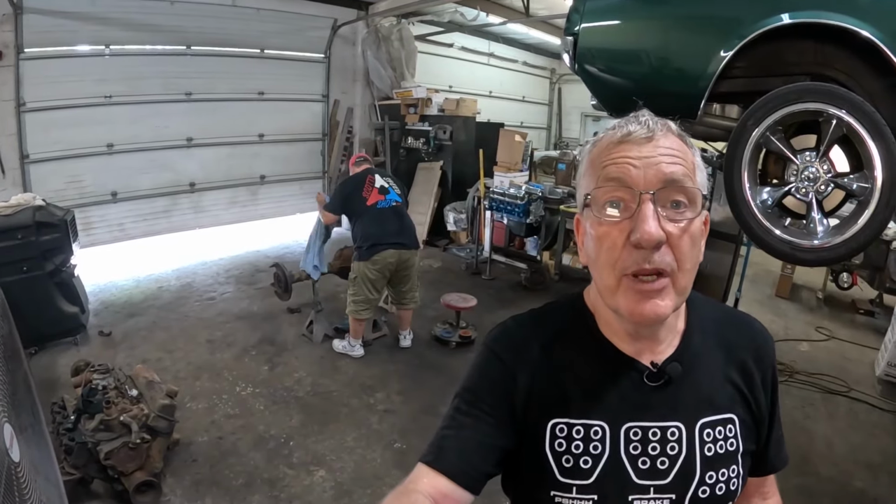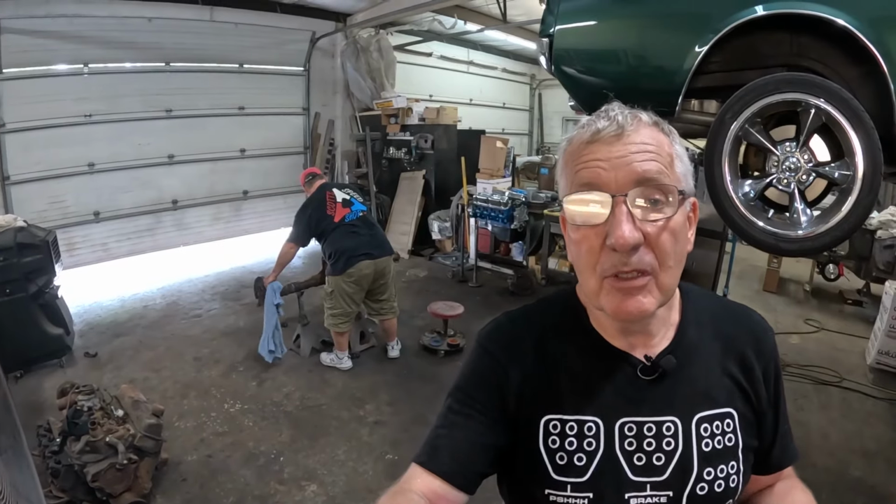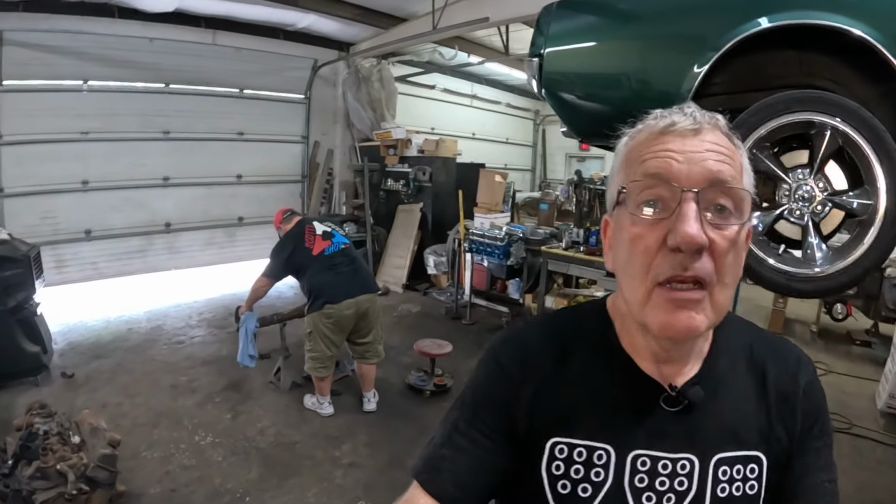Now, the beauty with the 8.8 rear, it shares the bolt pattern with the Mopar. Very cheap. He picked up a complete limited slip rear end with disc brakes and a 4.1 ratio from the factory. That's a little uncommon, they're usually 3.70 odd, but he found a 4.1 limited slip disc brake rear for $250. Can't go wrong, that's cheap hot rodding. So he's got that cleaned up.